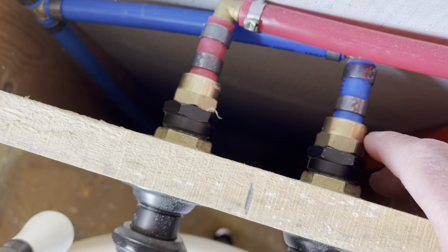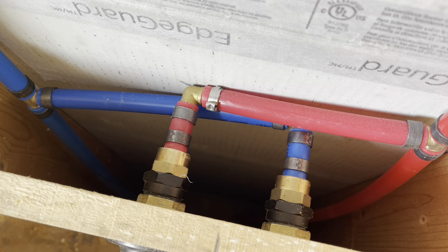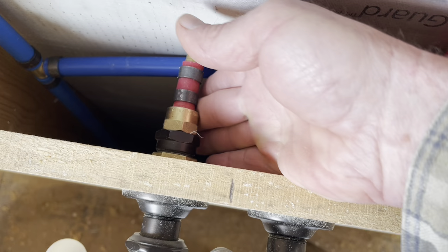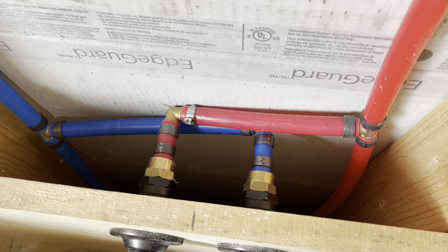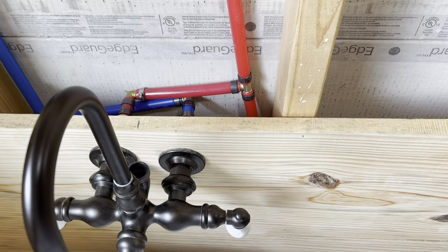That's why I left the panels off yesterday — that way I could come back this morning and check it. Because if you do have a slow leak inside a wall, something that's not going to show on the floor, then you're going to have problems. It could be just a drip every five minutes and it's still going to be a problem. But I think I'm good — there's no water there, no water there. I always like to check all my fittings and keep pressure on everything. The whole time we were doing drywall, I always keep pressure on these lines — that way if you run a screw or finish nail through a pipe, you're going to see it and fix it before everything's finished.